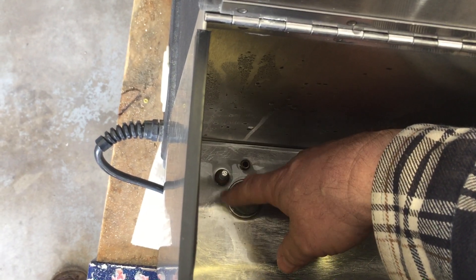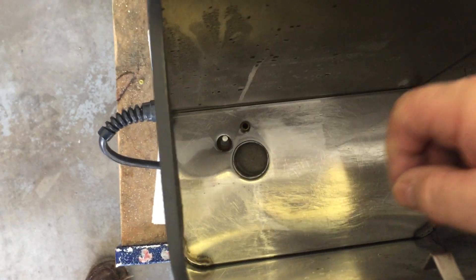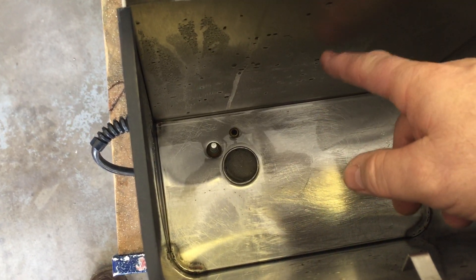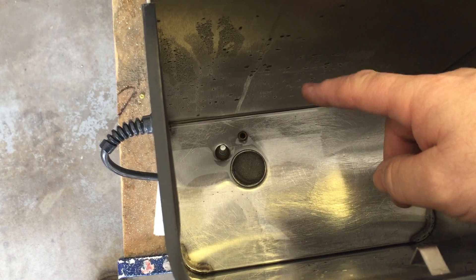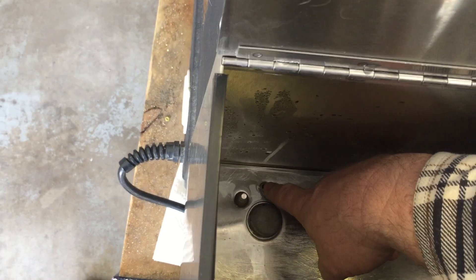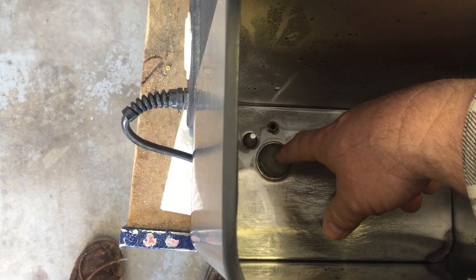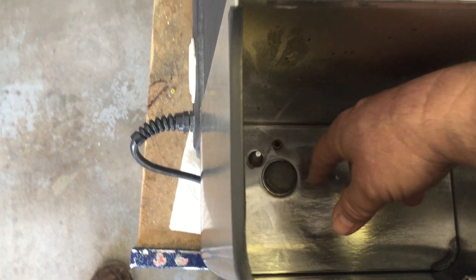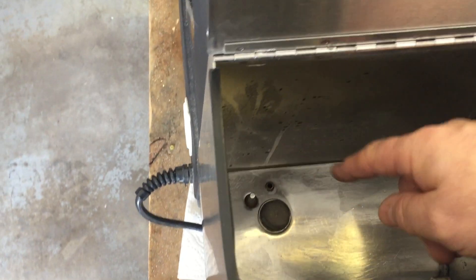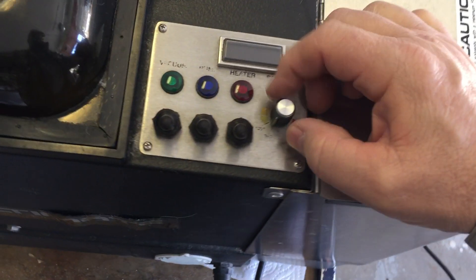Let's take a look at the solution tank, which is stainless steel. There's a screen there for the intake. This device here is actually a sensor — if you put solvent in this tank, because this machine will clean with solvent, it'll show something interesting. And this little port right there is actually a recirculating port, so it intakes here, and when you turn on the pump it'll be continuously recirculating without going through the heater.